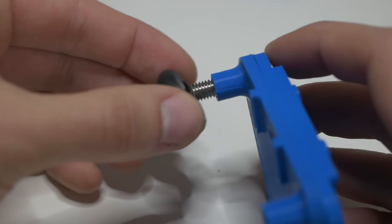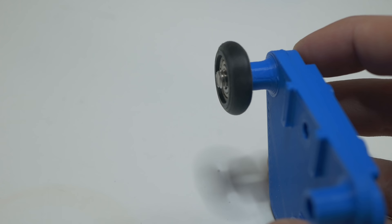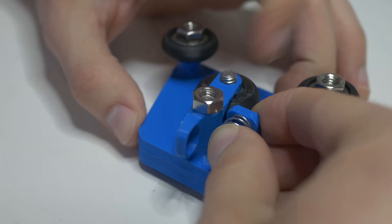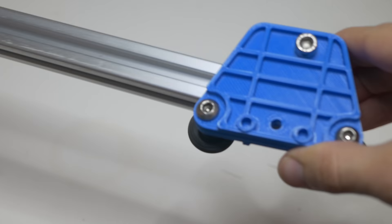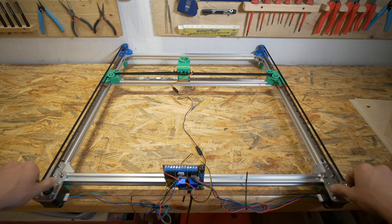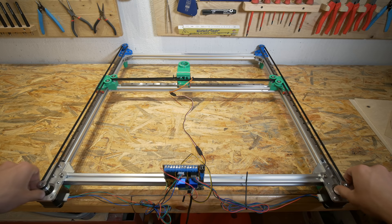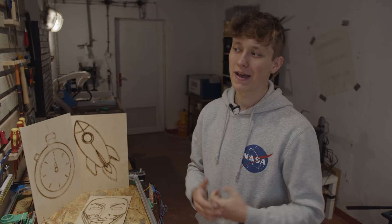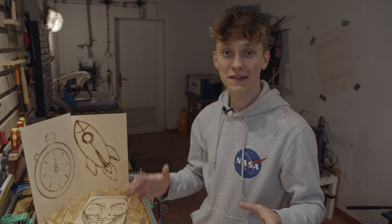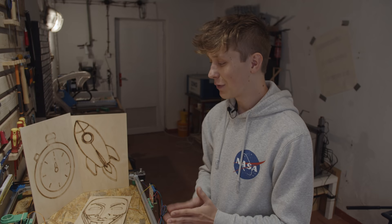I started this design with the idea of creating a spring-loaded mechanism with 3D printed wheels that would go smoothly on the aluminum profiles. At least that was the idea. The first prototype was working actually pretty good, but the problem was that with the H-Bot construction there is a lot of force because of this long belt that goes all around the plotter. So you actually need to have a really stiff construction. Unfortunately, this idea of a spring-loaded mechanism wasn't really the best, but for some light stuff it could really work great.